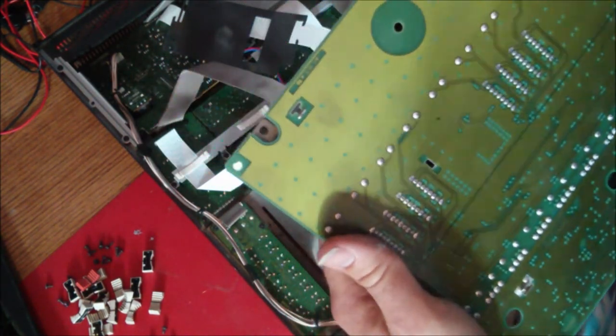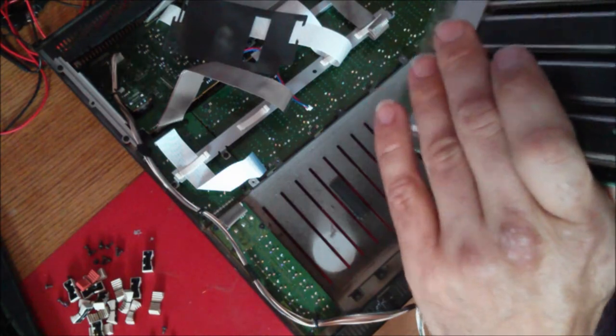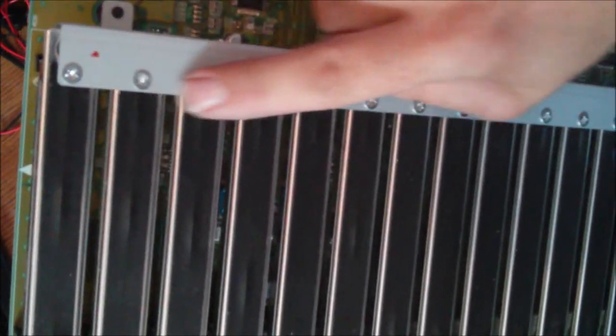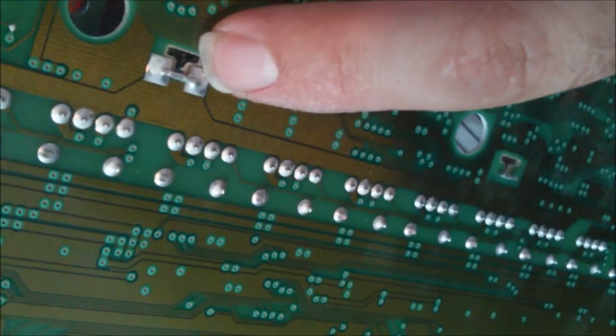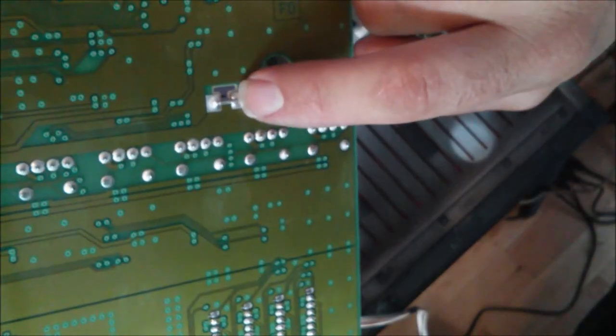Now, if you want to replace one fader on this board, there's a few more screws you have to undo here. Now, if you look at this bank of faders, this board here, you have to take out each screw on each fader. So, of course, there are 37 screws to remove here for these two rails. And beyond that, there's a couple of solder joints you've got to work on. So you've got to desolder this T here. It's on the backside of one of the rails, and this guy over here. You've got to desolder both of those with your solder sucker tool.